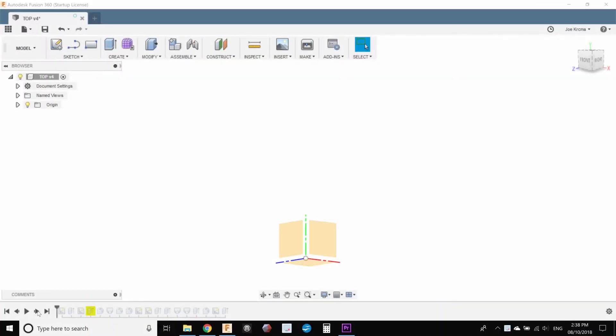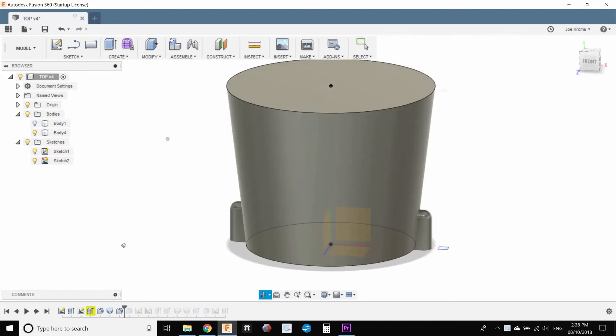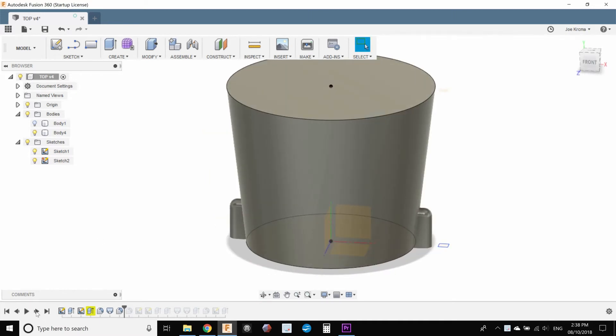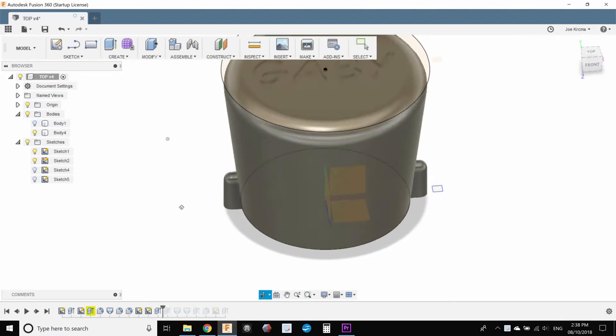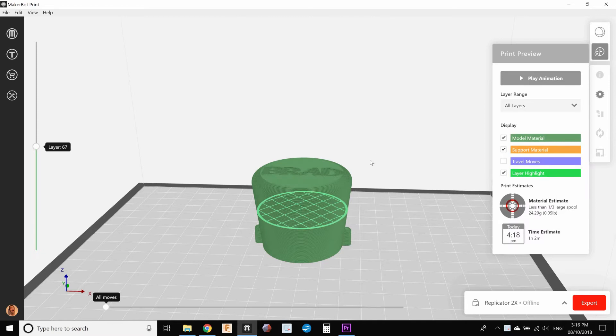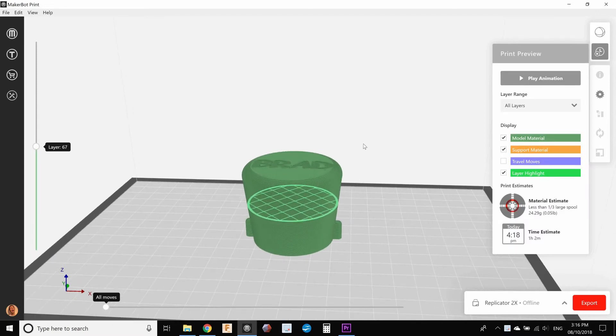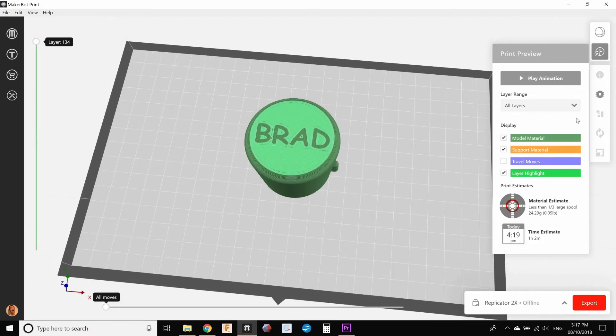Let me show you how I did it. I first designed the little latch nubs that are gonna hold the lid on to the blender. I then lofted the two circle sketches to make kind of a cone shape. Then I gave it a nice fillet edge and simply cut the names with the text tool into the top. I cut the text about one millimeter deep. I then sliced it with three shells and about 12% infill. This is hopefully gonna make it strong enough where those little tabs aren't gonna fall off. They're each going to take just over an hour to print and won't use that much material since the infill isn't super dense.